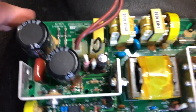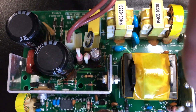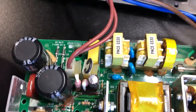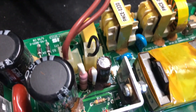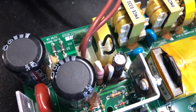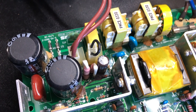Here I have the board out and ready. The problem is with this electrolytic capacitor marked as C8 — the little tiny battery-looking one — and these two resistors right next to it. It's a design failure: those resistors heat up during normal operation and, due to their close proximity to that electrolytic capacitor, cause it to completely dry out and no longer function properly. I've got to replace it and distance those resistors from the capacitor, so I'm going to desolder and pull out that bad capacitor.